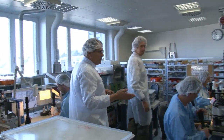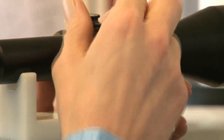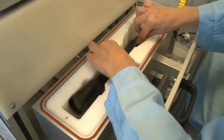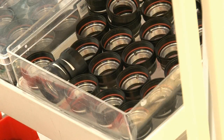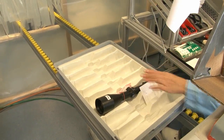The final control stations perform an additional parallax test and check all the last steps — controlling the elements, the positions of the reticles and everything else. As the presenter notes, they started with the idea of scopes needing water and air, but now in the 21st century it's about no water and no air. Dust is the main enemy because the eyepiece is a magnifying glass and enlarges the size of any particle inside, so scopes are made waterproof and fog-proof.